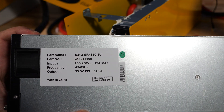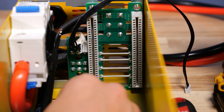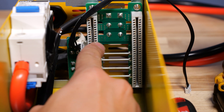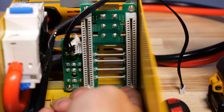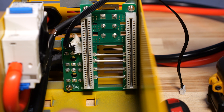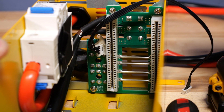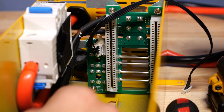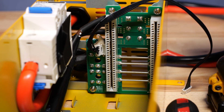Here is the label on the module if you're interested. There is just this interface PCB with connectors that the boards slide into. Your AC power is right here on these three terminals, and you can see pretty clearly it splits between each one. There are wires bringing the DC power over here — it's good that they didn't put a full-on solid PCB here that would block airflow, so this still allows heat to get out of the power modules. This board just has two connectors: one wire goes to the breaker, and the other wire goes straight out the back. As far as controls go, it's all going to be through the board edge connectors — that's how it gets data to the modules to set their output voltage and current, and all the magic happens inside the modules themselves.